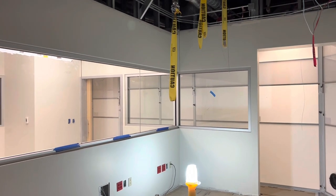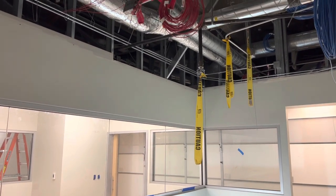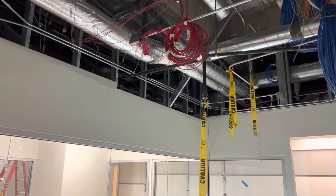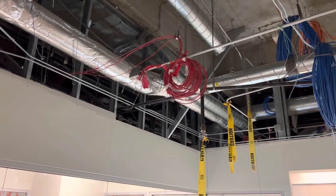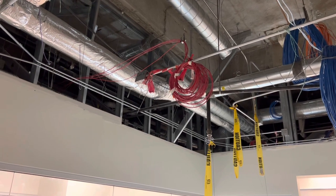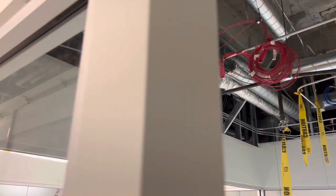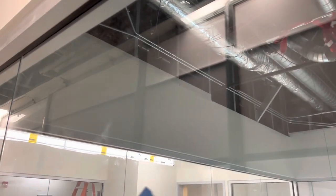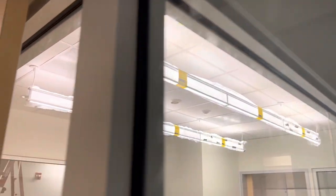From there I went over to the other room where they made some more changes to the fire alarm. Basically I had to open up a couple devices, reroute some wires, pull some new wires, and then tie those wires back together. I was going to show you guys on a blueprint exactly what I did, but I forgot to take a picture. I'll try to show you that tomorrow if you're interested. Basically I opened up the chime strobe on this wall and then pulled a new wire back to that loop and back into this room.